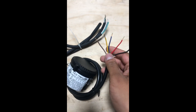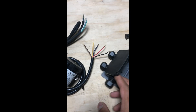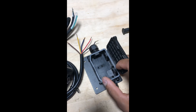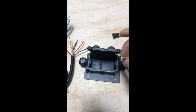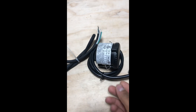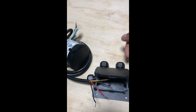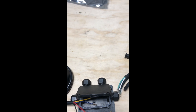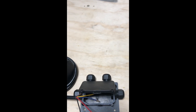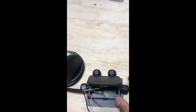You will make all your connections using the trim clamps provided. All your connections must be placed inside of this box. What you will do is insert this pigtail in here — you will insert the zero to ten volt dimming, the power input from your light. We supply a little pigtail that will go in and connect to your junction. Otherwise you can directly put an SO cable from your junction box instead of using this pigtail directly into the junction box.